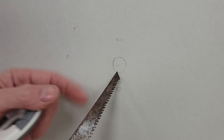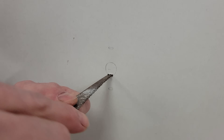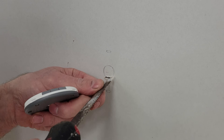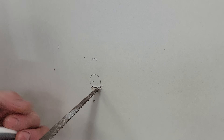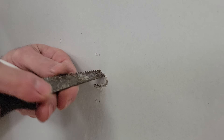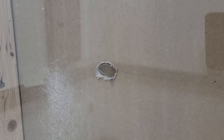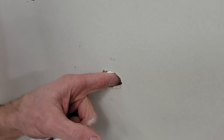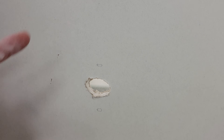I don't usually drill these holes out with a drill in case there are electrical wires inside. I just use a keyhole saw and I don't hit it — I just twist it because of any nail pops that could occur. You can kind of feel around; if you feel maybe electrical wire or something like that you can stop. If the saw is not sharp it's not going to end up cutting it. You've got to be real careful when doing this on an existing wall.